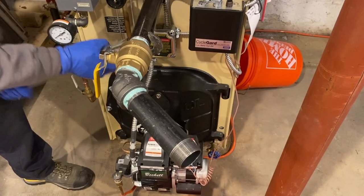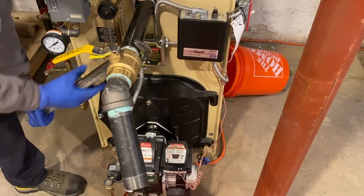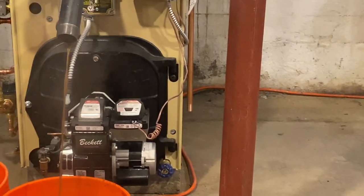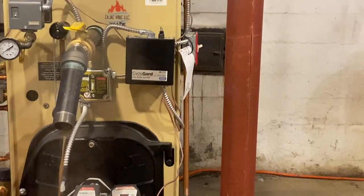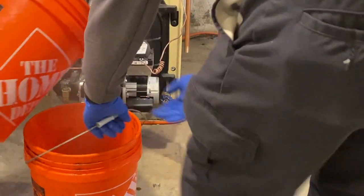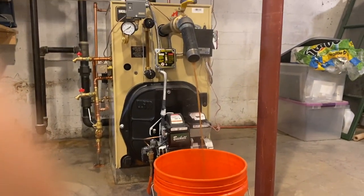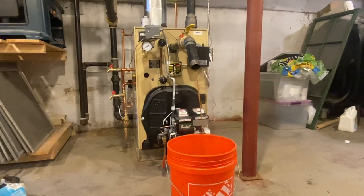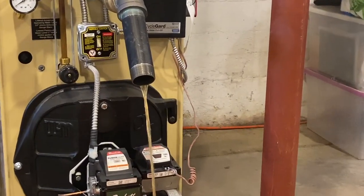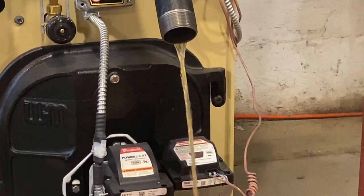Running that cleaner through it tends to loosen up all the stuff and return it back to the boiler. So the skimming removes all the oils and all the nasty stuff from basically the factory threading oils, the oil from the boiler, anything like that. So it can prevent surging and banging of steam pipes and that kind of thing. As you can see between the different clips, the water is getting cleaner. Got the thumbs up there.